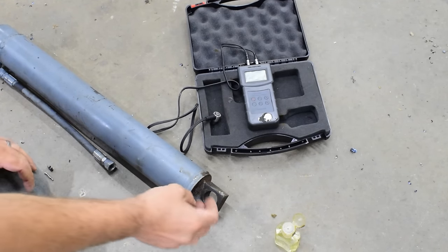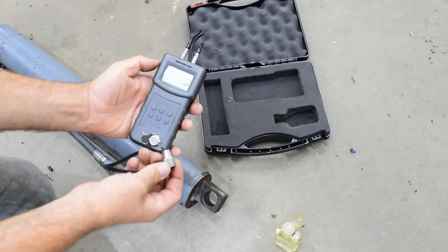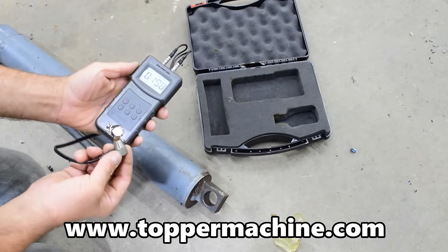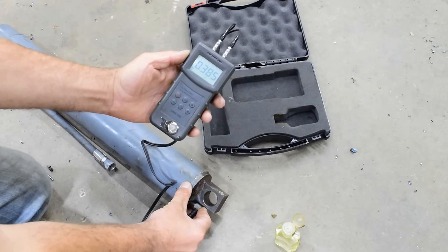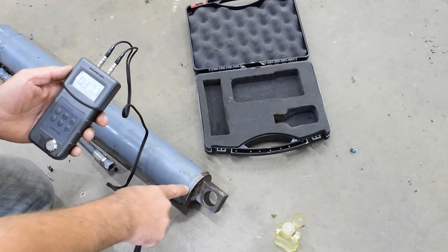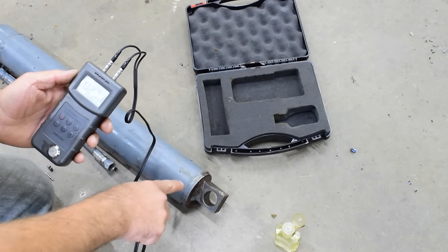The first thing we're going to do is cut this end cap off, but I don't know how thick it is — that's where this comes in. This is an ultrasonic thickness gauge. I use it for boiler testing, but also for other things in the shop. We'll calibrate it, apply a little couplant, and touch it to the end cap. Reading 385 — so we're about three-eighths of an inch; 382, 377, depending where I wiggle it. So it's a three-eighths inch cap. There should be a little step inside the tube and a chamfer that's welded, so I'll shoot for cutting just a little less than three-eighths and try to get it to pop off.